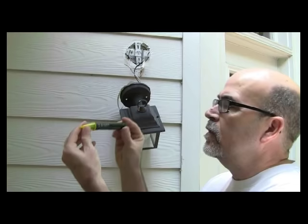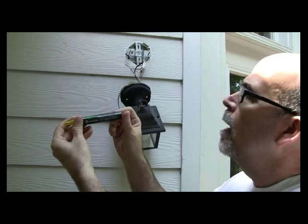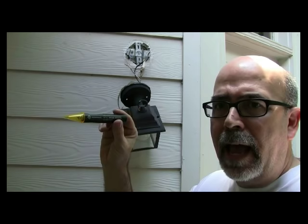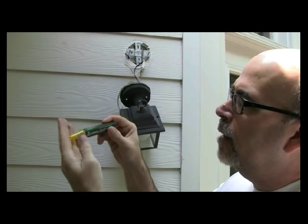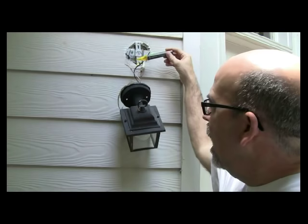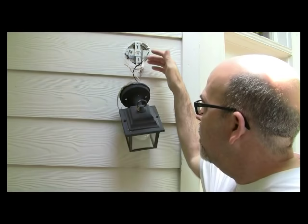One other good thing that I like to do — this is what I call a sniffer. It's actually a voltmeter, a voltage detector. It has a particular edge to it. I turn it on at the side. This takes a AA battery. Every once in a while it'll tweet — if there's any voltage it would tweet. There's no voltage, no power here at all, so I know the line's completely dead. This is not my problem here. I know that the current goes here if it's on, so we're going to replace the switch — that's what it tells me. All the connections are good, so the only thing to do now is to replace the switch.